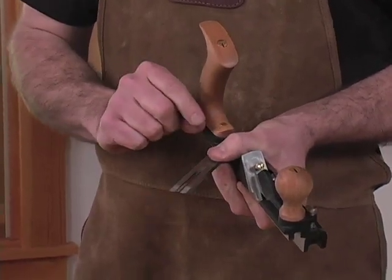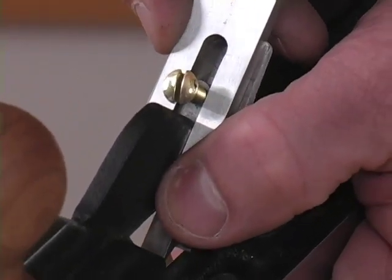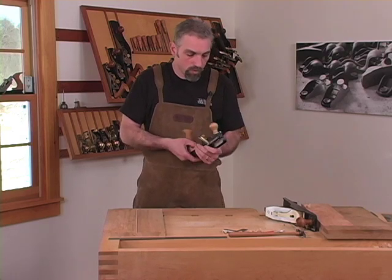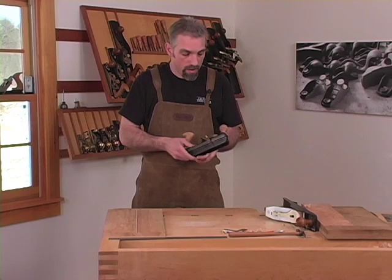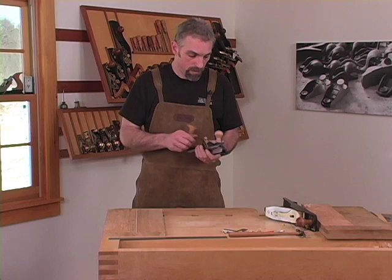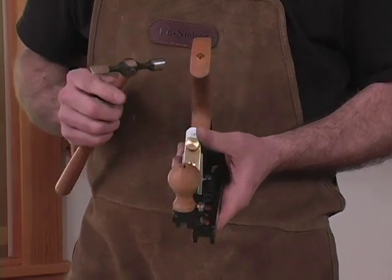The blade has a slot down the center, quarter inch wide. That ensures that you achieve a quarter inch tongue. Slipping the blade over the center post, you'll find a snug fit. That ensures that the blade cuts square to the body of the tool and will leave a quarter inch shoulder when cutting the tongue piece. It also means that you have to sharpen the blade square. I simply use a 30 degree secondary bevel — that way I don't have to polish the whole primary bevel. It doesn't have a depth adjuster; it's not needed because this is a heavy removal tool designed to take a lot of material quickly. A small, lightweight hammer will give you all the fine adjustment you need.